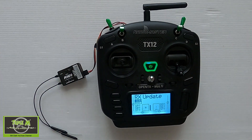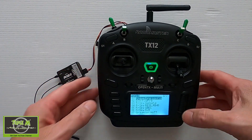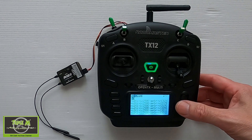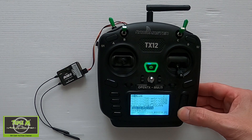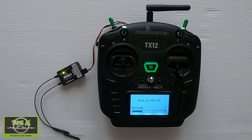Let's go ahead and do this. You can see the power go straight to the receiver. Now I'm going to do the same thing again — go to our System Menu, go across one, down to Firmware, and make sure it's the correct firmware: version 2 for the R168. Choose Flash External. I'll leave this in real time so you can see how long it takes and you don't panic if you think it's not working.